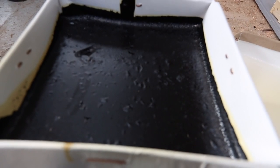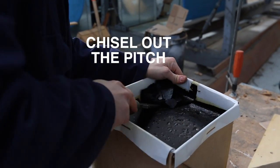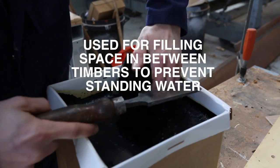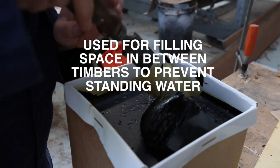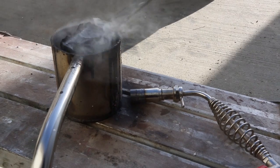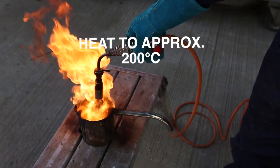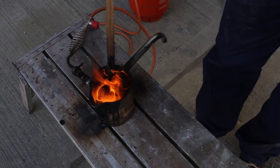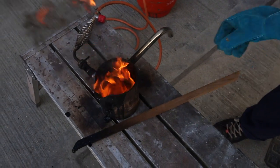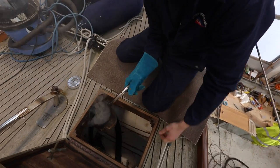So we've got Jeffrey's marine glue, or pitch, chipping it out of the packet it comes in — it's pretty hard. It's used mainly for filling gaps or places where water will sit and stand in the boat, which you don't want. Mainly in the counter-sterns of boats, in between the frames where they joint up to horn timbers and various other places where water will sit.